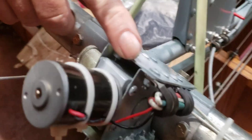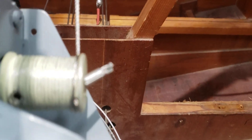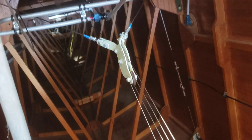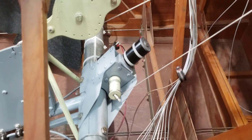I'll go on the other side of the airplane. That's the gear. These motors are about 30 bucks on Amazon — it's a 12 or 15 RPM motor. We've built a little can right here that looks like a thimble; the cable wraps up on this. It's a simple block and tackle system. These cables hook directly to where the original spring was hooked up, come down through here, and hook onto another little block and tackle. We fabricated a bracket and got it set up real nice so it works nice and straight.